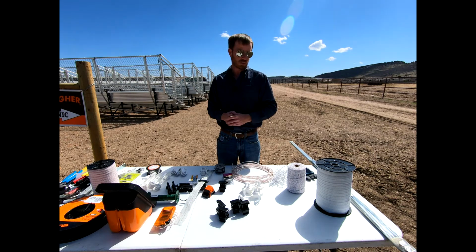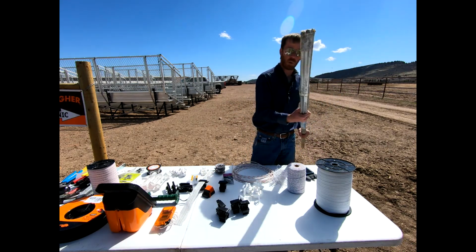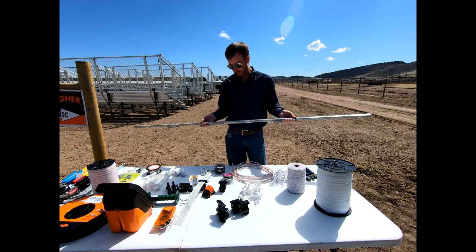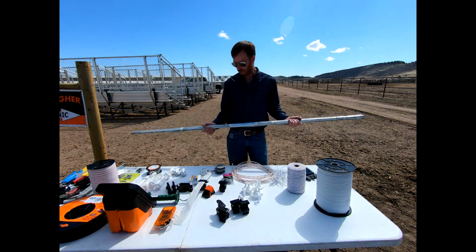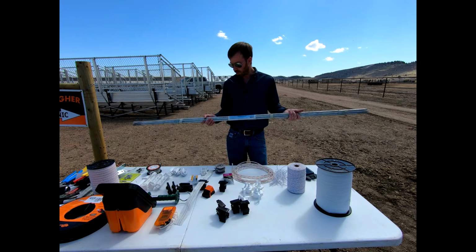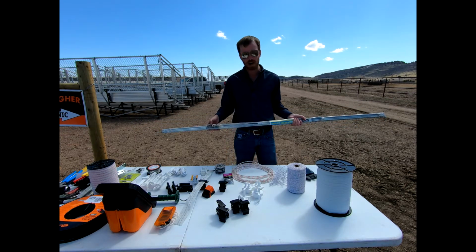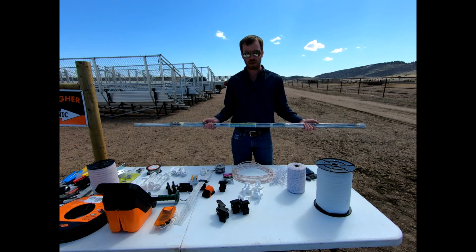When it really relates to grounding, it's extremely important that you have a good grounding system in. For purposes of today, I'm probably only going to put one ground rod in just for the effort because it's only a demonstration. This is a package that you can buy that basically has your 3 ground rods in it. These are all zinc or galvanized ground rods. We no longer suggest or recommend copper. Within this, it also has a grounding wire that you can connect each rod to and a number of clamps. So all within this, you have a complete grounding system as well.